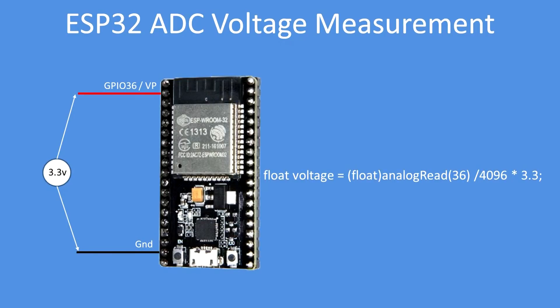To begin with, a reminder that the basic analog-to-digital converter voltage input is VDD, which is 3.3 volts, minus a nominal 0.3 volts — so ideally 0 to 3 volts for a linear measurement, but it will actually measure 0 to 3.3 volts. The basic measurement range is 3.3 volts. The expression is: float voltage = analogRead(pin 36) / 4096 * 3.3, making it a 3.3-volt meter.